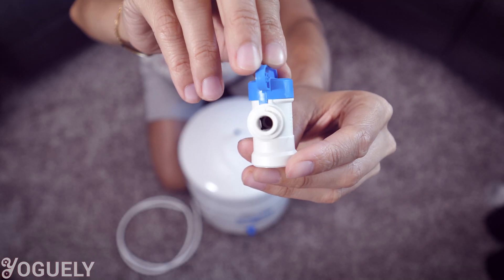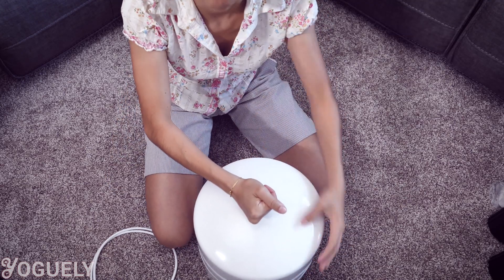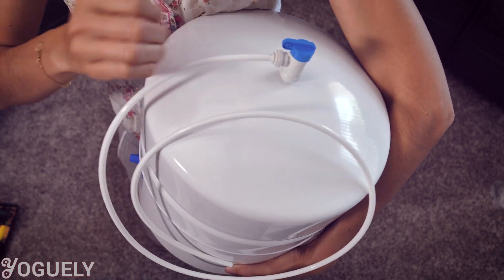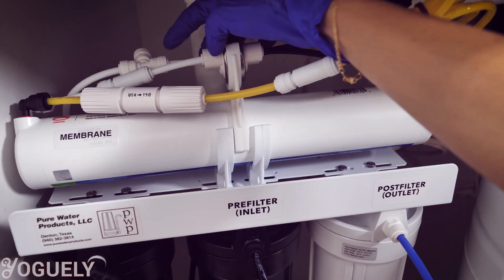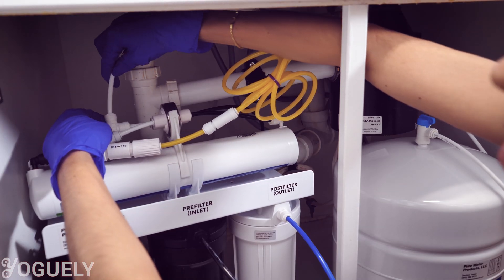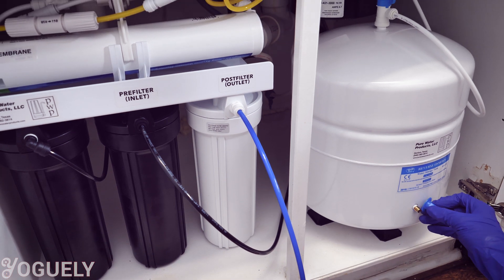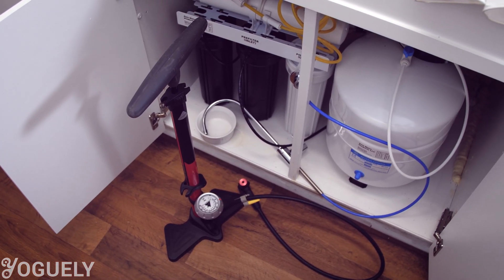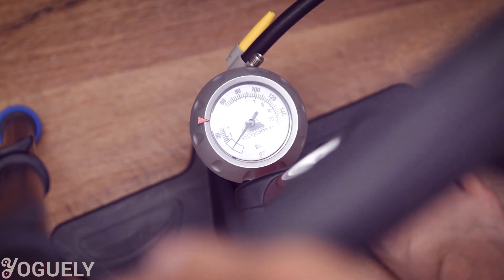We're almost done. Prepare the water storage tank by screwing down the tank valve on top — do this by hand to avoid over-tightening. Attach the white water pipe by pushing it inside the tank valve until snug. Place the water storage tank under the sink next to the reverse osmosis system. Connect the white line from the tank to the last remaining quick-connect fitting on the T-fitting on the top side of the membrane. On the front of the storage tank is a blue cap covering a Schrader valve where you can inflate the tank just like a bike tire. Since this system is brand new, the tank has been pre-pressurized to 7–8 psi; with time the pressure may change, requiring regular maintenance.